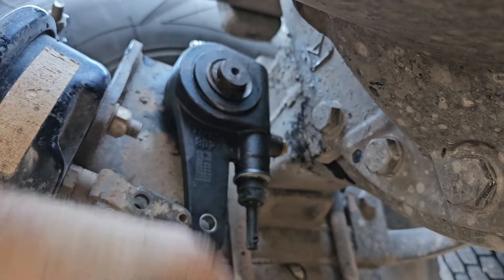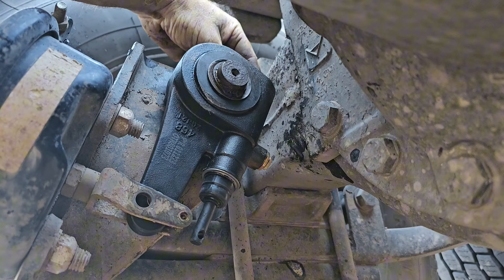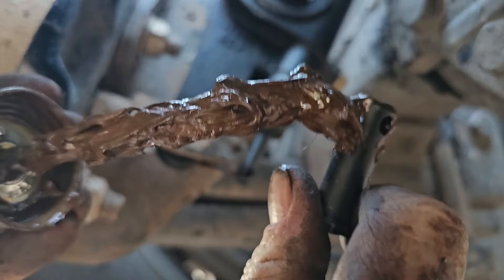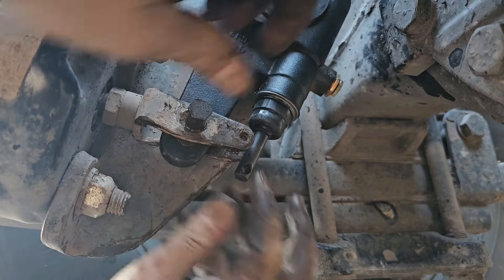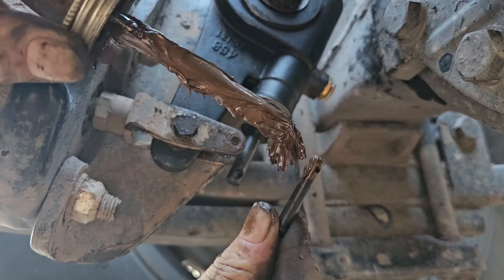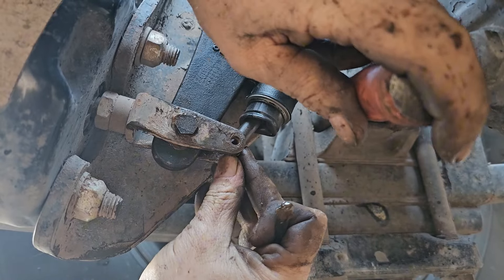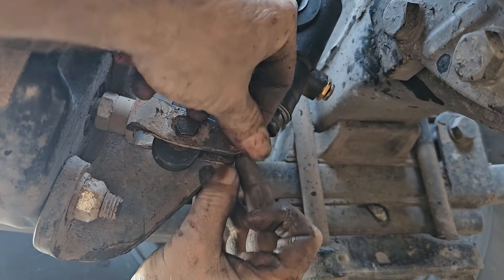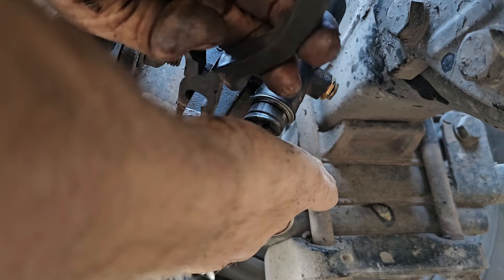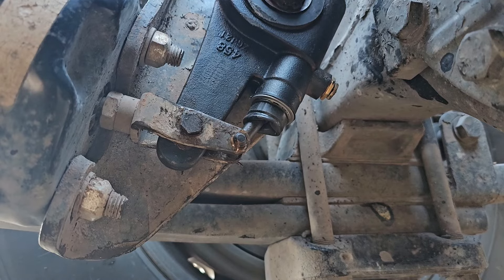Now you just turn the adjustment screw counterclockwise on the top and get it lined up with that clevis. I use a ton of anti-seize on the pins. My wood chisel came in handy again — the other end this time — to drive the pin in. Use anti-seize on the small pin too. Notice that little piece is a little too long — you pull out on the tab, push up where it needs to be, let off the tab, then stick your pin in. To get the cotter pins back in, I hold one end of the pin with vice grips to keep it from turning, then use needle nose pliers to splay out the cotter pins on the other side.